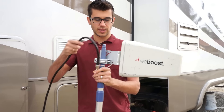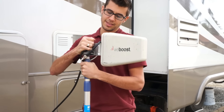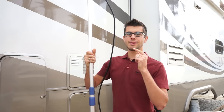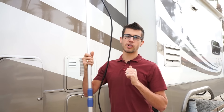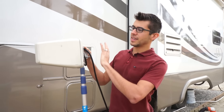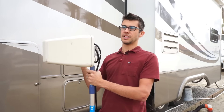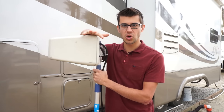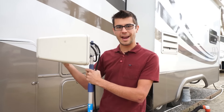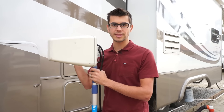We connect the cable to the antenna just like this, and then extend the antenna up in the air on this pole. I take this pole and brace it against the ladder on the back of our RV to get it way up in the air. When setting this up, you want to make sure that you've got the antenna connected all the way back to your booster before you turn your booster on, because it's designed to work with this load on it. If it doesn't have the load on it, it can overheat and damage itself — it'll actually give you an error a lot of times and won't turn on. Otherwise, you just turn it on and it starts boosting and that's all there is to it.